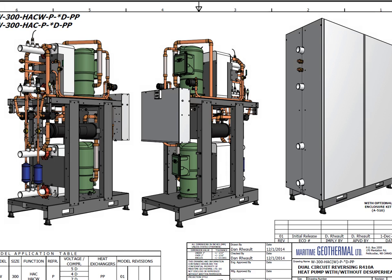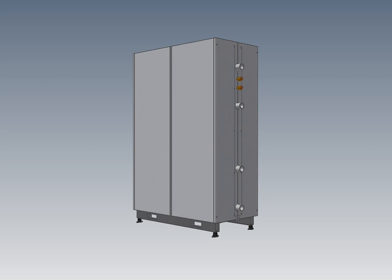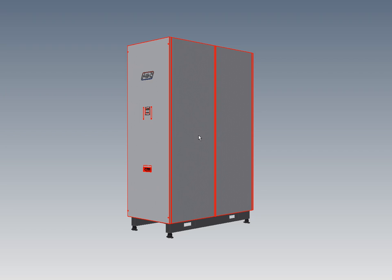For heating mode, the R410A machines allow a minimum source temperature of around 25 degrees Fahrenheit and a maximum indoor water temperature of around 120 degrees Fahrenheit. Traditionally we've manufactured commercial water-to-water heat pumps in a rectangular cabinet, which would often need to be stacked in racks at the job site. This new unit is a slim vertical style unit, which is very convenient for multiple unit installations. Units are lined up in a row with all the victaulic water connections aligned horizontally.